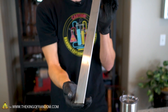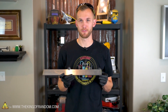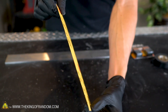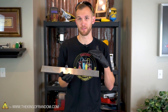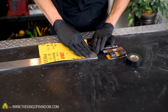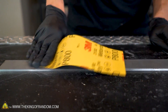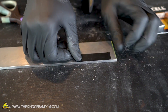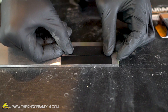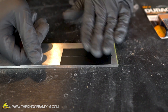Let's start out by testing our high carbon steel bar. To be sure we have a nice clean and non-oxidized surface to work with, let's get some high grit sandpaper and just go over this whole bar. That will remove any oxidation or grease that may be on the surface of the steel. Now let's use some electrical tape to mask off the areas that we don't want to engrave. This will adhere closely to the steel, so we shouldn't have to worry about any of the water seeping underneath the tape.